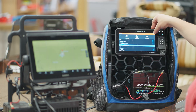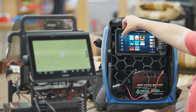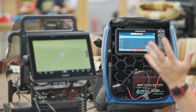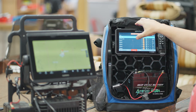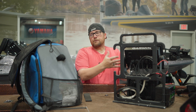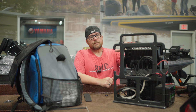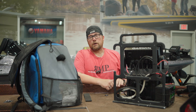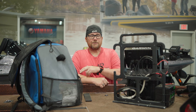We exit out of that, and then we can go to our main screen. We can hit 'Waypoints.' So now we had zero — now we've got all of our waypoints here. And if we go over to trails, because we didn't have any routes, there's our trail. So we've got all of our trails saved. So on our Garmin, we save all as a GPX file onto the SD card, transfer it over to our Lowrance, just import it. Now we've taken our Garmin waypoints and converted them over to our Lowrance unit. If you want to know the opposite way, you can check out our other video from Lowrance to Garmin.